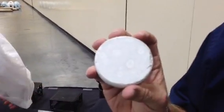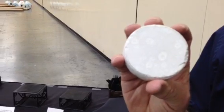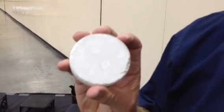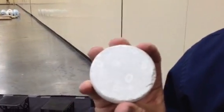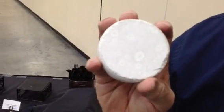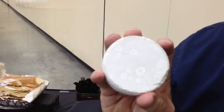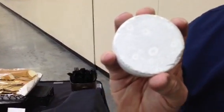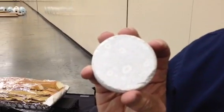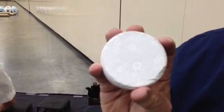What we believe is the cause of these white spots forming is twofold. One is that the darker area around them is gray. We believe that is caused by the addition of calcium chloride to the plaster mix during mixing and application. The reason plasters like to use calcium chloride is that it accelerates the hardening process and allows them to finish a pool within about three hours. In the olden days without calcium chloride, it would take eight hours to finish a pool. So calcium chloride is done for convenience and to speed up the process so that plasterers can do more pools in one day.